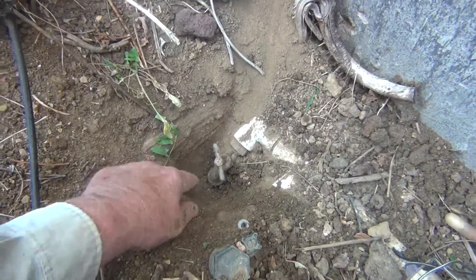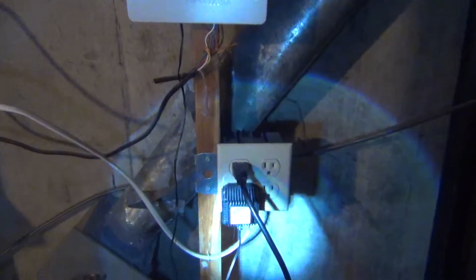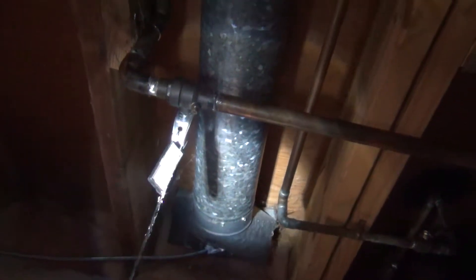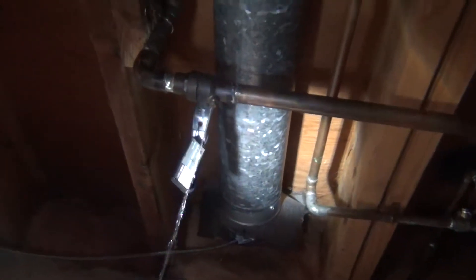Just got it so I make sure there's some air getting underneath so the dirt isn't holding all the water in. For the sprinkler clock I'm just going to pull its plug. The whole time that water was running, this cap was in my pocket. Come back, all that water pressure. I'm going to let this drain and do the same thing to the inlet pipe over by the main line.